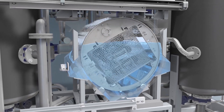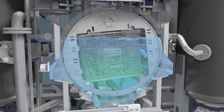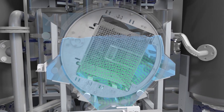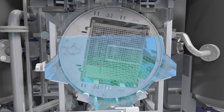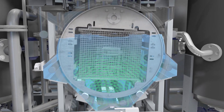This is a very powerful machine with ultrasonics, spraying, injection flood wash, and three tanks for filtration, so you can wash, rinse, and rinse. Typically all your cleaning is done with your first tank — washing, washing, washing — and then importantly for all water-based systems, rinse, rinse, rinse to get a stain-free finish.